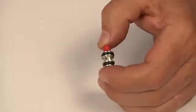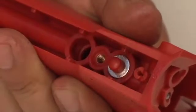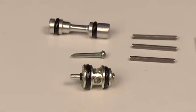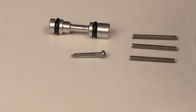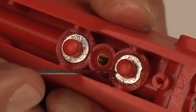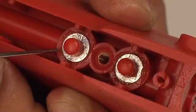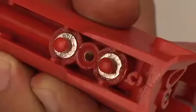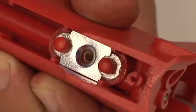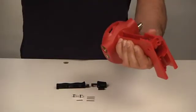Apply special grease too. Then, place the push-button unit in its seat, using pliers. Carry out the same operations for both push buttons, making sure that their end stop is flush with their seats. Then, reassemble the plate kit, locking it using a 2.5 mm hex key.